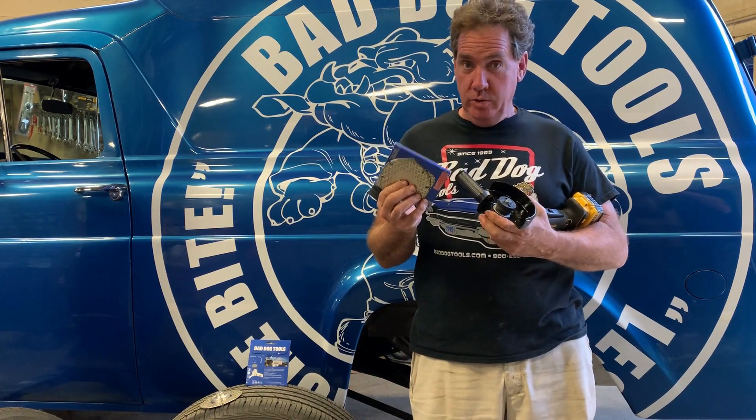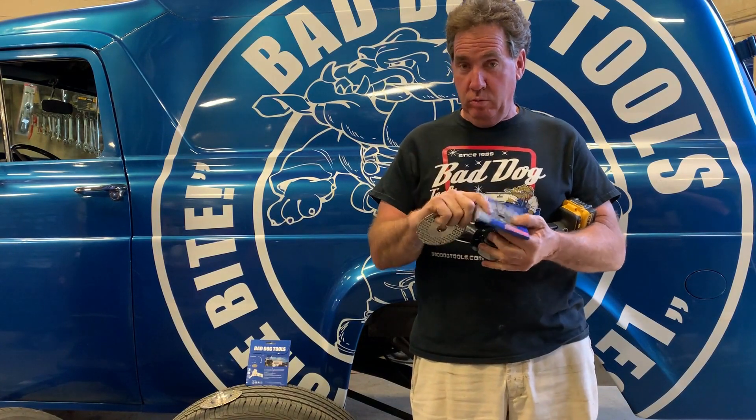So you just got your HD2, you've got it home, you want to know how to mount it on your four and a half inch grinder. This is how you do it. This is our little HD2 right here. You've got two choices: you could have gotten the one with the 7/8 hole or the one with the 5/8 hole. I'm suggesting that you get the 7/8 hole if you haven't bought one yet — it'll fit better and be smoother cutting.